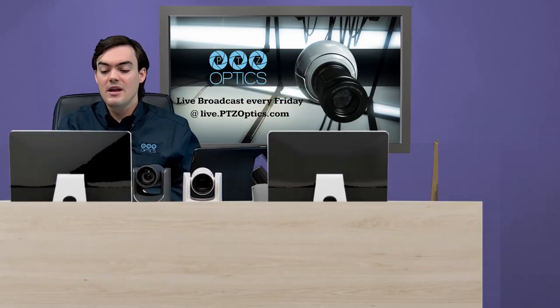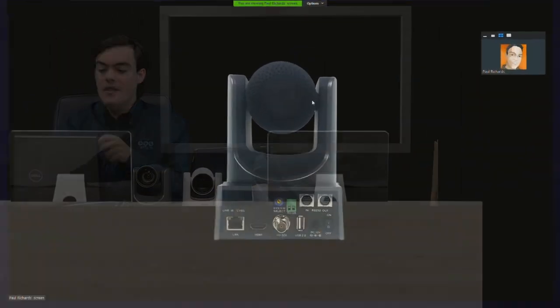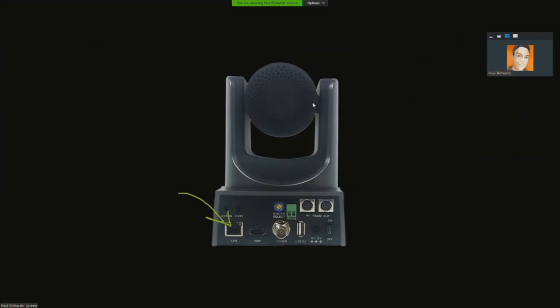Now let's take a look at the back of the camera. As you can see here, we have the ability to do IP streaming so we can stream directly off this camera. We can do dual streaming — one 1080p and one SD live stream. We can also control the camera from here and set a static IP address. There's a line in that embeds with the IP stream so you can send video and audio. We've got an HDMI out and that HDMI is simultaneous with the HD-SDI and the IP stream — great for a confidence monitor, an HD recorder where your main stream is coming off HD-SDI to a broadcast switcher, while IP handles streaming or control. All three are simultaneous and they're all set by the system select tool right here.